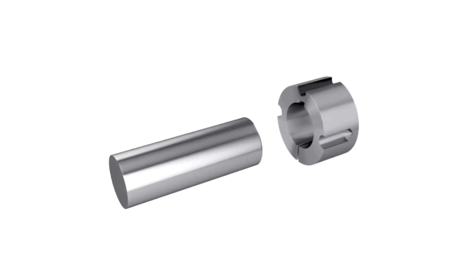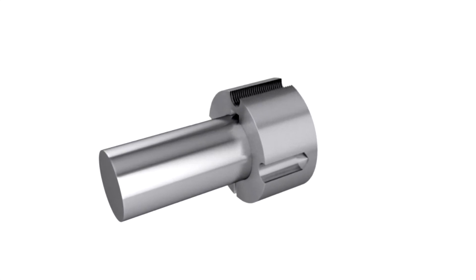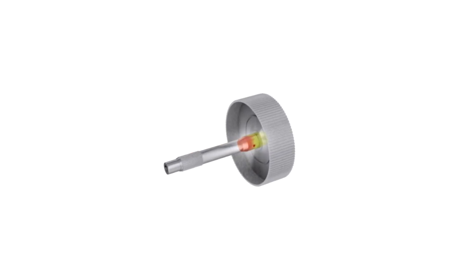Conical bush devices are flexible, but could be more costly and result in reduced torque. The shrink fit process is efficient, but is difficult to remove and expensive to maintain.